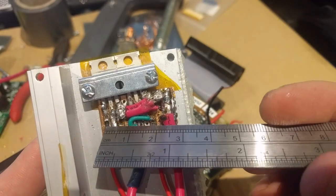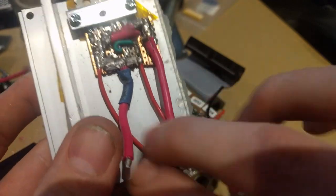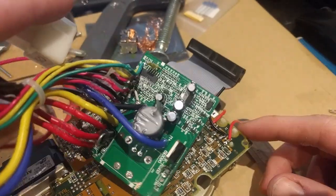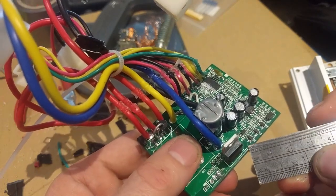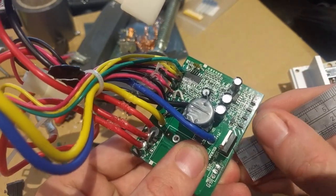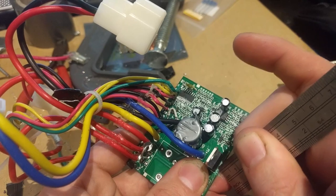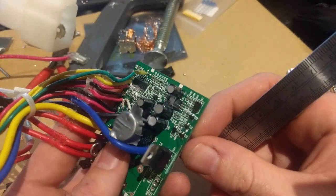After a fiddly little bit of soldering, we now have a gate resistor for our first MOSFET here and a gate resistor for our second MOSFET here going through this lead to the gate there. So we've got two gates, and a drain and a source. Our gate comes off this little R30 resistor, comes along this big long trace and goes to T4. We're just going to scrape the solder mask off that trace so we can solder both our new gate leads to that trace. You always want the shortest possible line going from your gate driver to the gate of the MOSFET because it cuts down things like oscillation and makes the transistor turn on much quicker.